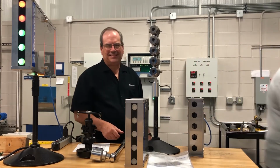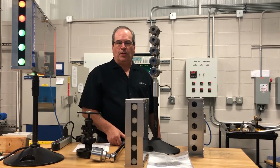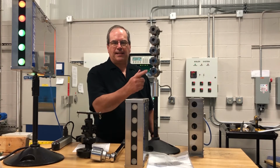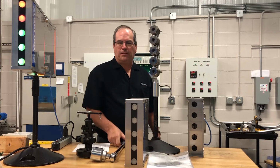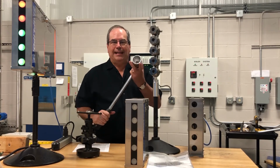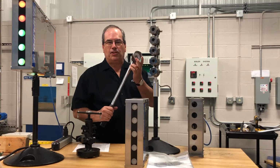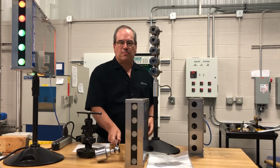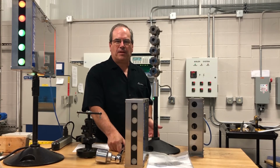Thank you, Frank. If you're installing a new or a maintained gauge glass on your boiler, verify that the torque of the packing nuts is set to 100 foot-pounds before placing the gauge in service. Any repairs on any existing gauge or new gauge should be done with a calibrated torque wrench and follow our maintenance procedures that are supplied with each of our products.